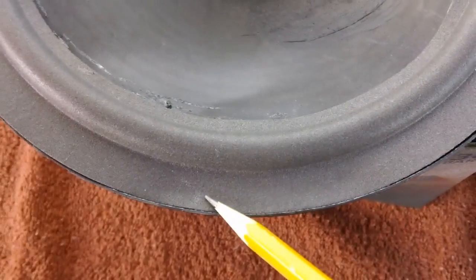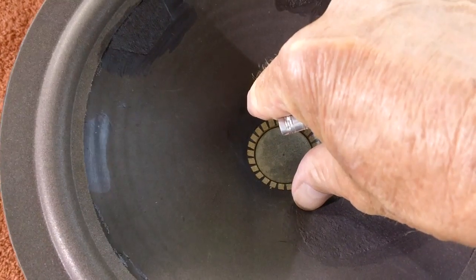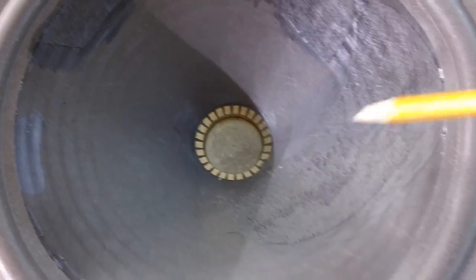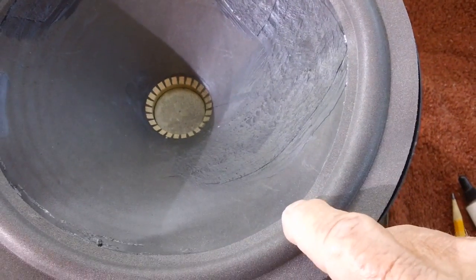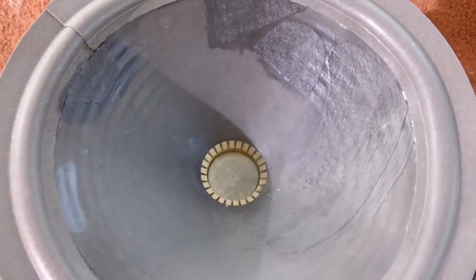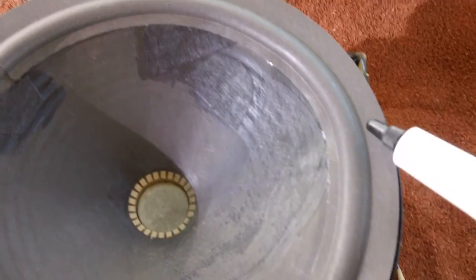Just right here is where we left off yesterday - that's what's left of our little X that I put there, because that part is glued. I may take it around to about right here with glue, then hold it down with my fingers until she dries real good, and then feel the cone - very quiet down there. After that's glued and I know we don't have a lot of rubbing sound here, I'll go a little bit further around. It's a patience thing - take your time. I may have to pull the speaker this way or that way to keep that rub from happening. I've got to feel my way around and do the best I can. Just a little at a time, maybe 3-4 inches, then another 3-4 inches.